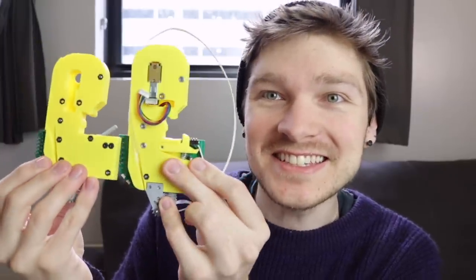But when I put one of these together without all the wires hanging out, all kind of integrated, I realized there were quite a number of things I needed to tweak. So then we got this one which is just a little bit longer. This is now Rev 7. And another huge difference is the little PET-G print that was for holding the feeder onto the rail — it just wasn't cutting it. It did not push hard enough onto the rail to make sure that when you mount the feeder onto the machine, it's not going to go anywhere.